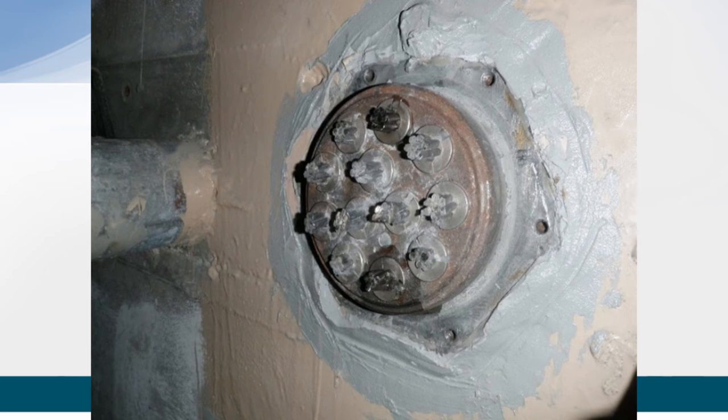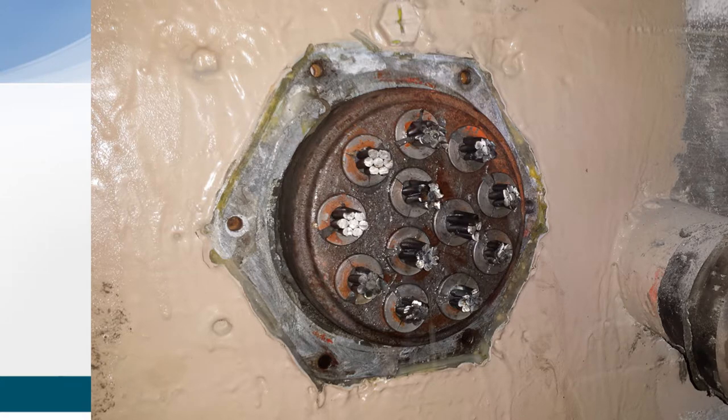In the case of impregnation, again, you're going to put a cap on the end. You're going to fill it with this low viscosity liquid, and you're going to push that liquid through the tendon assembly. It's going to travel inside the strands along the length. And then once that's filled, it's going to soak in between the wires of the strand into the surrounding grout. And I think you'll see this more clearly in the project photos following.